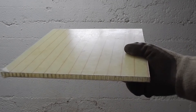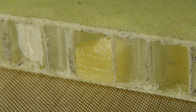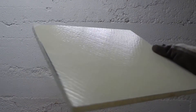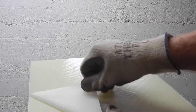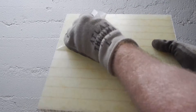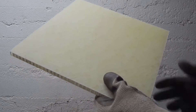Here is the trimmed up panel. You can see those dark spots inside are where resin went through into cells. It seems like there was a difference cell to cell in porosity — some cells got a lot of resin and others didn't, and I'm not really sure why. It seems kind of random; maybe there are small holes, or maybe once a little resin goes through, more follows. You can see in the top surface the dimples of the core — less vacuum would have made that less pronounced. The bottom uncoated peel ply peels off a little harder than the polyester on the surface, but leaves a nice finish. There's a little bit of air in there — it's not perfect, but for a wet layup it's pretty good.